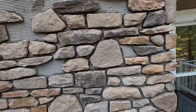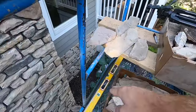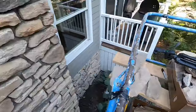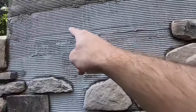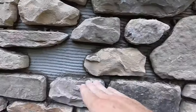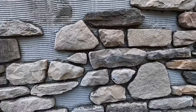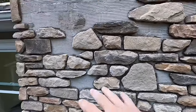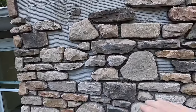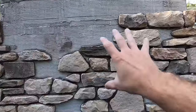Now that we're up here, I'll talk about what I do when I'm laying out my stone. The first thing I want is a level surface to work off of — that's what my level's for. I got my level, my marker, and I put a black line across about every three or four feet. Here's my last line — a straight level line. It looks better from the ground and it's easier to work off something already level.